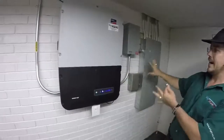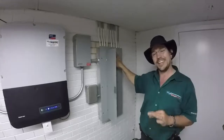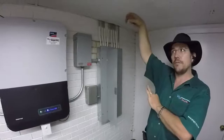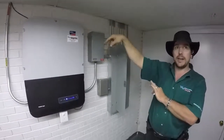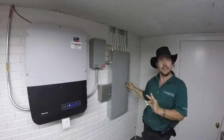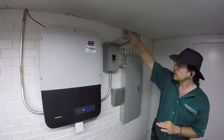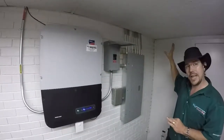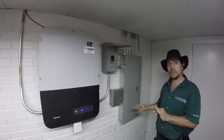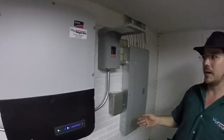Then we go over to our AC side. We are not connected at all to this breaker box because this breaker box gets its service through an automatic transfer switch. We have actually tapped the grid feed port of the automatic transfer switch to ensure that the solar and the generator don't ever play together, because they don't get along too well unless there's battery in the mix. So our breaker for the solar is in here, but the external service disconnect is outside. That is its own separate tap service from the main meter — it is on your side of the meter, but it's before any of your other breakers.